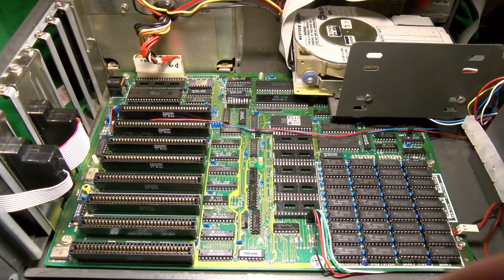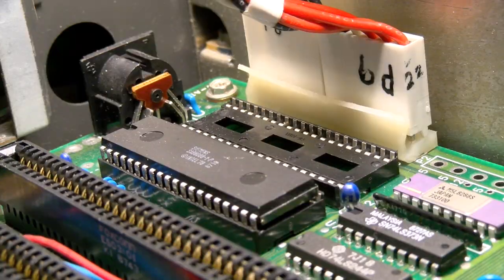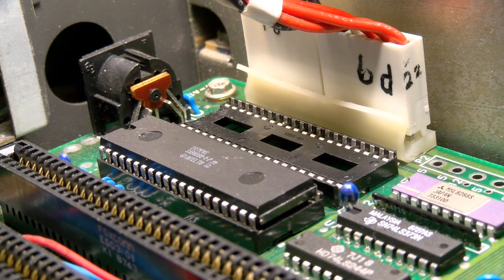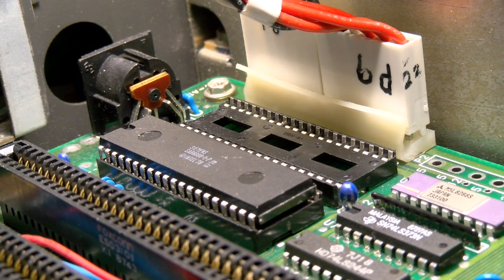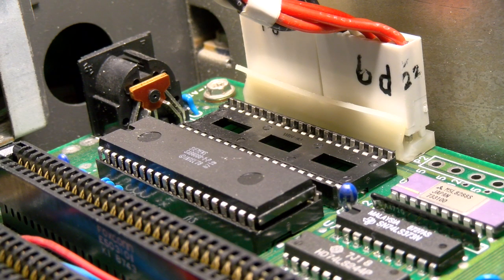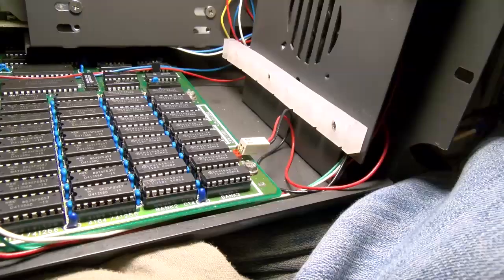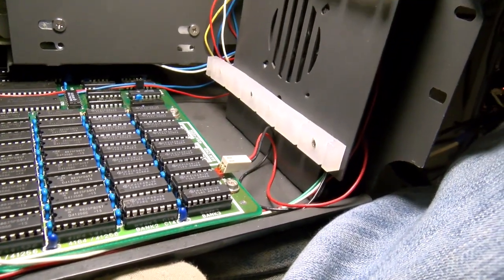The IBM one might be a problem, as I think it has overclocking detection, and so it would know that the system was 8 MHz and could possibly refuse to run. But, hey, I wouldn't want that BIOS anyway, it sucks, give me the clone BIOSes. And even the clones didn't bother writing their own BIOSes in the end, because you had companies like AMI and Award and Phoenix, you just license it. And that was real convenient.